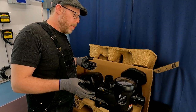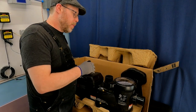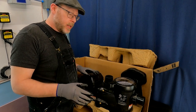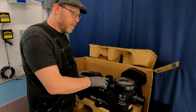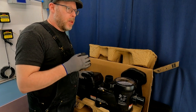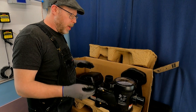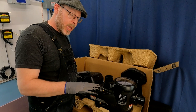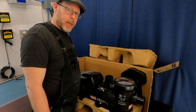This pump is available from a brick-and-mortar dealer only — pool professionals can provide it to you. You can get another version of it online that's similar but not exactly the same. It's not going to have the same warranty. This one has an upgraded Viton pump seal that doesn't come with the other one. The one you buy online — the SP3202VSP — is the same motor size at 1.85 horsepower, but it is not dual voltage rated; it's rated for 230 volts only. That's yet another advantage of buying this pump from a brick-and-mortar dealer.